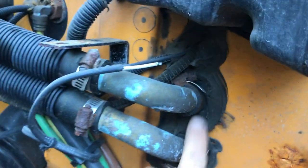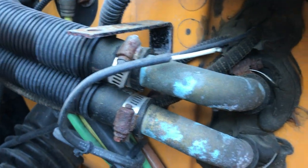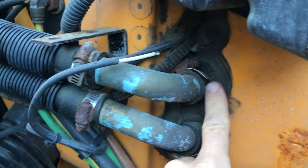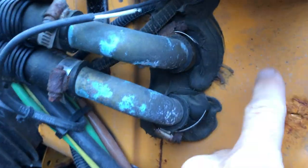The problem is I'm not exactly sure about all the different hose routes in there. The other problem is you get these openings in the firewall where the hoses come back through - even if I loop them inside the compartment I still have this opening where mice and stuff can get in, so I might as well loop it there. You don't really want to cap them because you need the coolant to flow through the entire system - one to cool the engine and use the other heat that works in the defrost and the regular cab. That's why we're going to loop it.